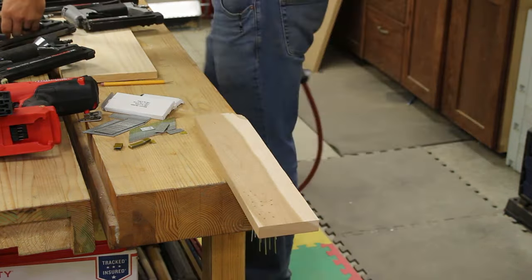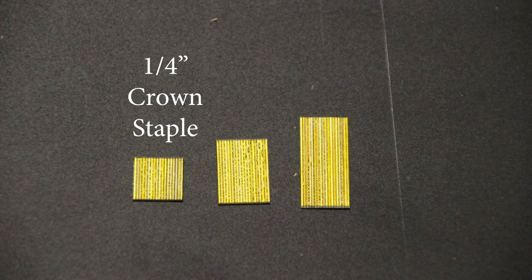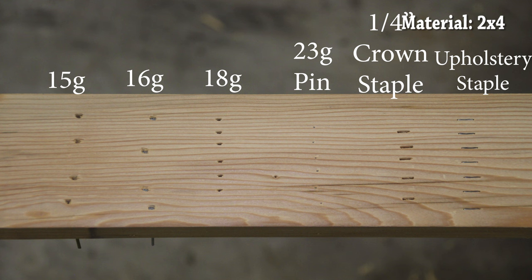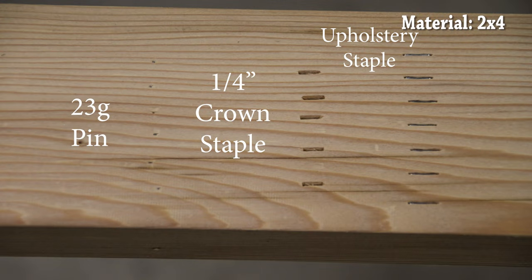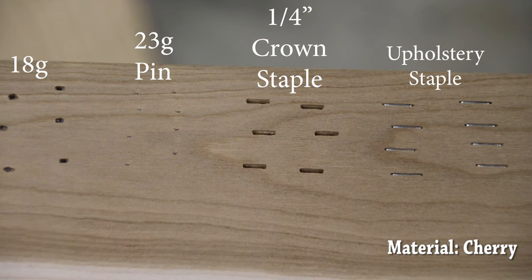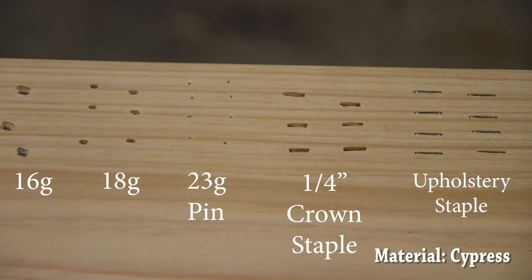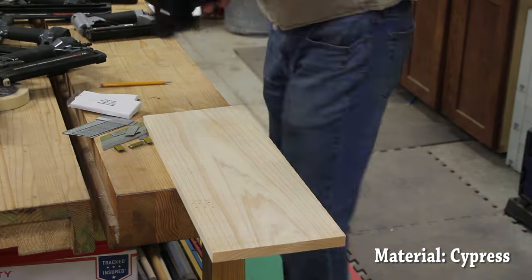These smaller nails aren't going to give you a lot of shear strength or pull-away strength — you're just tacking your part in place, applying a little bit of pressure with the pin nail until the glue can cure and permanently hold the two pieces together. Our final mainstream fastener is a non-nail type — it's the crown staple. It comes in a half inch wide or a quarter inch wide, and they typically shoot a fastener up to an inch and a half long. Crown staplers are great for specific applications in the woodworking shop for thinner material — quarter inch plywood, quarter inch MDF, hardboard, pegboard, masonite — where a brad nailer will not perform very well due to the small head and the very thin material. A staple is going to grab that in two different spots, bridge that gap, and really hold that material type to your work piece.